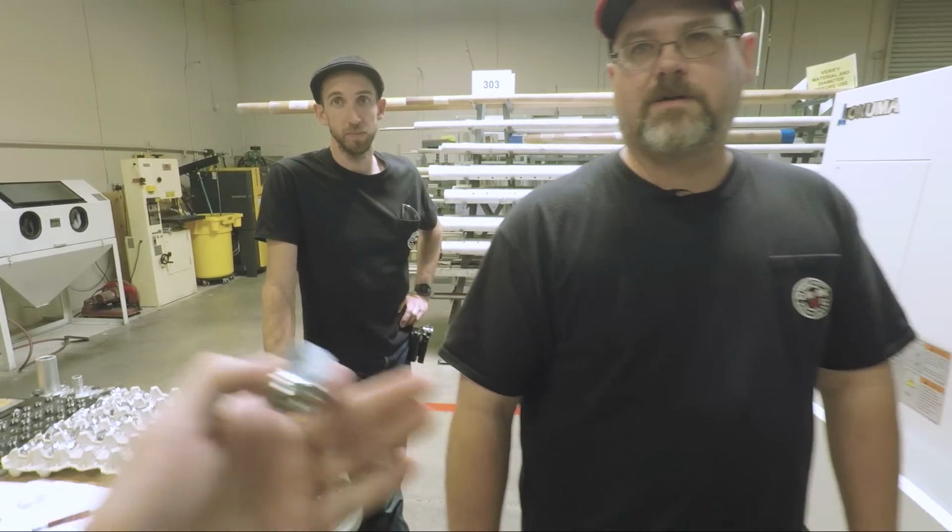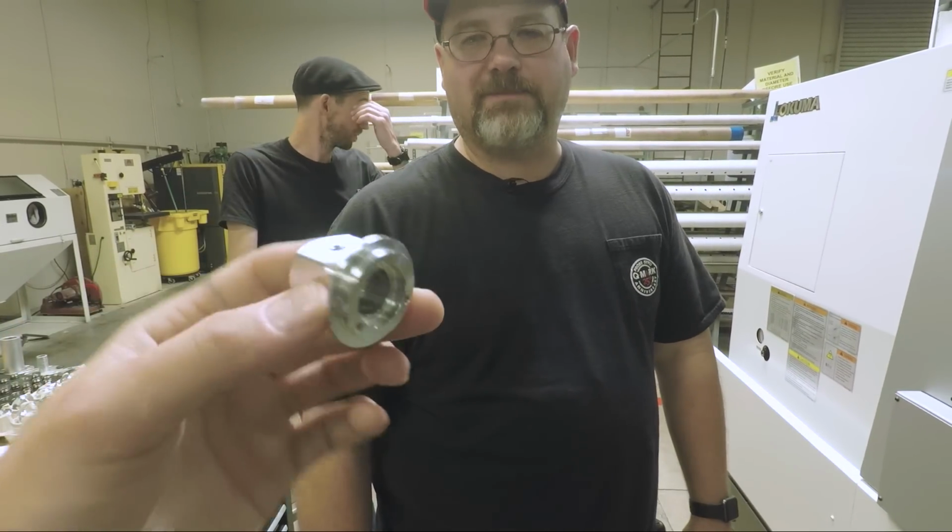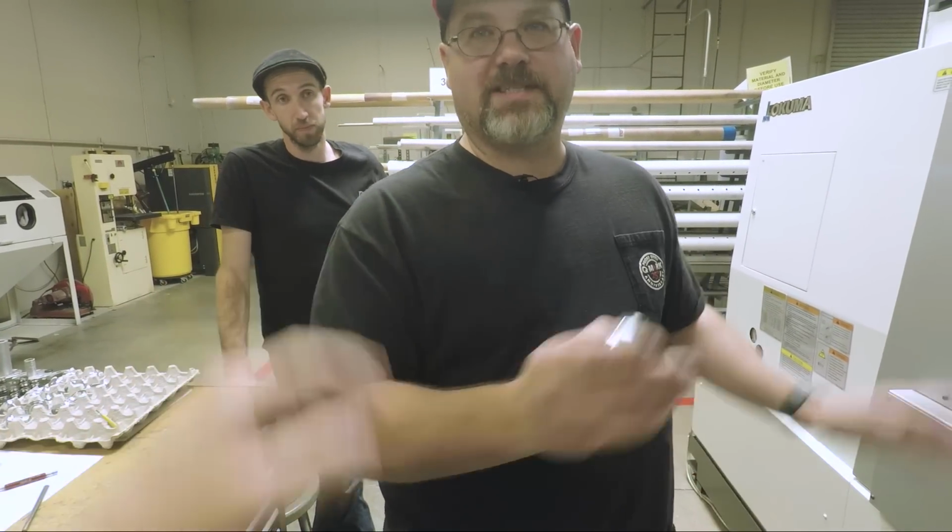Did you have mill turn, or did you have any live tooling on it? It was live. The other machine was live, but going from two setups to a single setup, getting finished parts. Looks like it's doing live milling, rigid tapping, rotating the part to tap all four faces. So cool. Looks like a VNMG or something to do some maybe finish profiling.